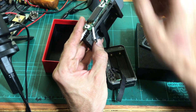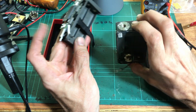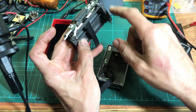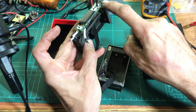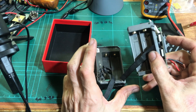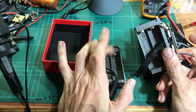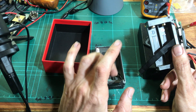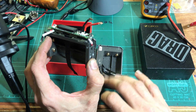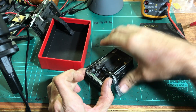Effectively there's a network of copper tracks that are all grounded. So if battery power shorts to the 510 negative — which is also the case because the 510 plate is electrically tied to the case — if one of the batteries shorts to the case, it's got to go back through the entire board to get back to cell negative. That's what will cook the board. So my initial thoughts are there's something shorting out — either wiring, or the cell can of this side cell shorts to the case and has to go back through the board.